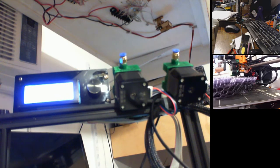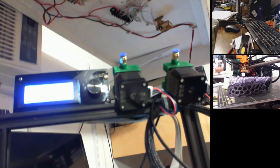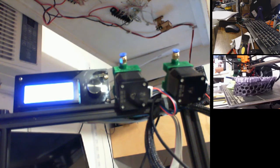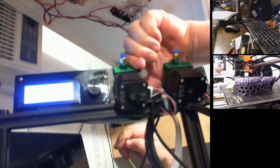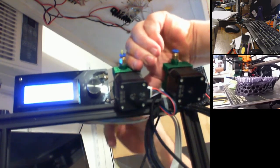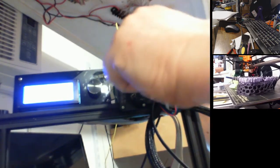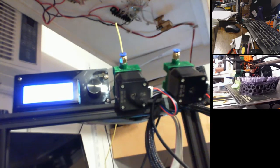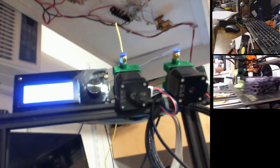Fire up so that I can, okay, so we got it online. We're on extruder 0. Let's see. Yeah. Oh, that one's a little tighter, but that's okay. All right, so we'll feed this up through there until we get to the mark. The mark is at the top edge of the Bowden tube. And so we got 100 millimeters already.